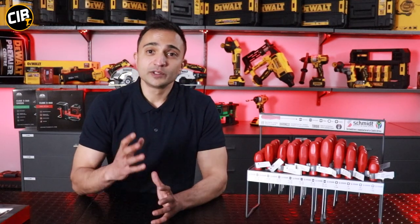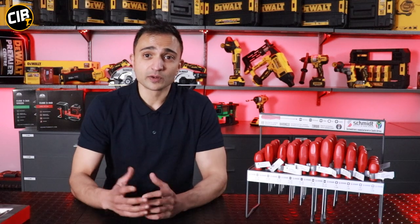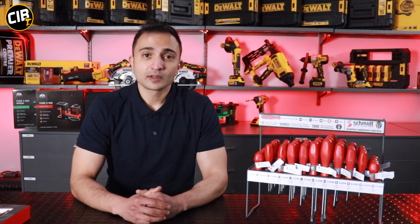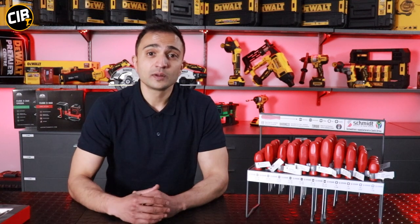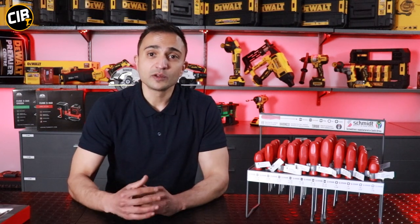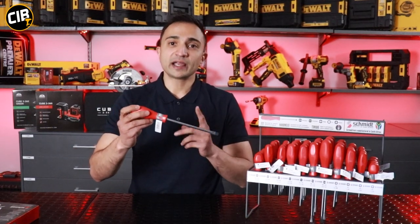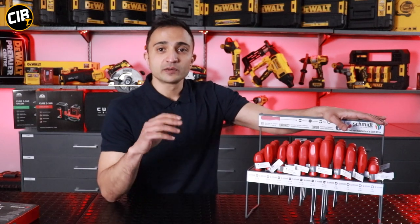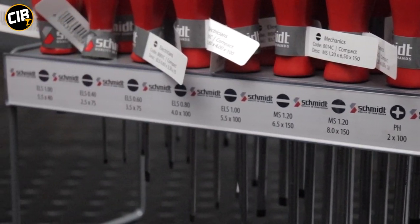As mentioned at the start of the video, we do have a product that's locally made. This year we felt it's really important for us to try and support some local manufacturers. Believe it or not, in South Africa there's only one screwdriver manufacturer left — and that's HWS Industries. HWS Industries have been manufacturing screwdrivers for close to 50 years. They previously manufactured under licence for the well-known Wiha brand, and about a year ago they decided to go on their own and manufacture the very same screwdrivers under the Schmidt brand. Every screwdriver is made from high-grade tooling steel with a black hardened tip and a square torque injection-moulded handle. In the range we have over 20 different screwdrivers — Phillips, Pozi, electricians flat, and mechanics flat screwdrivers.